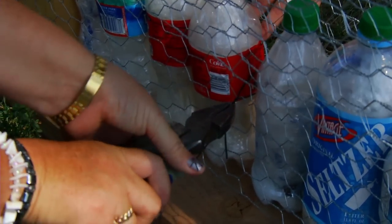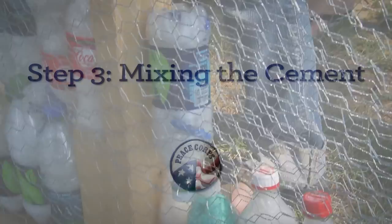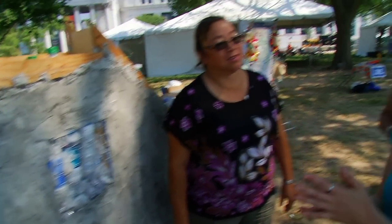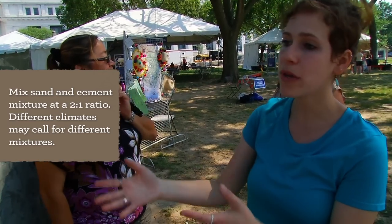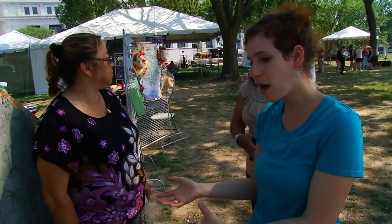Once you have a full row, the second one you start like this. The first layer of cement is usually two wheelbarrows full of sand to one sack of cement, or here we use two bags of sand to half a sack of cement — about 50 pounds of cement to 100 pounds of sand.